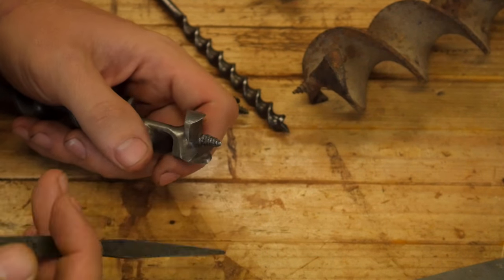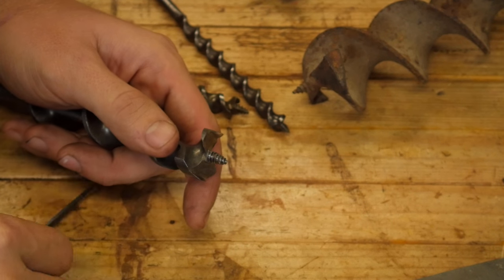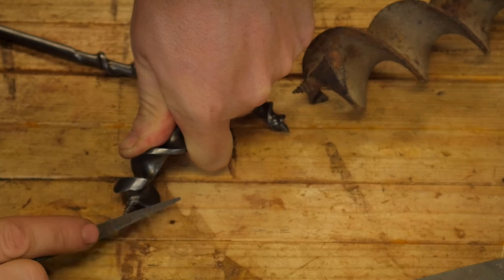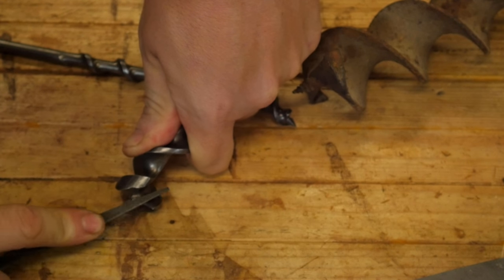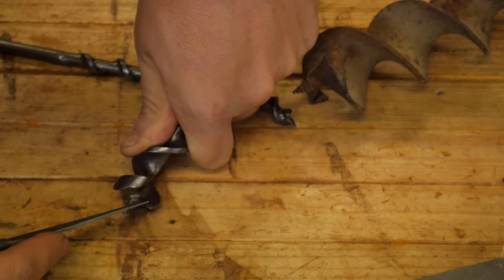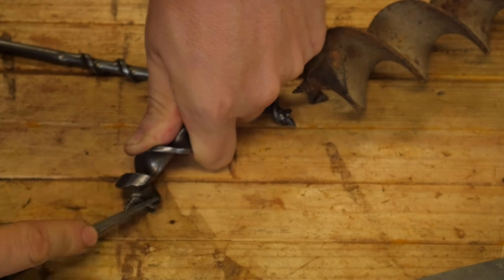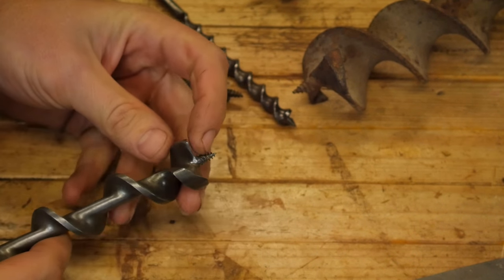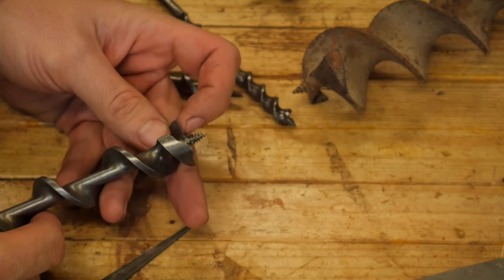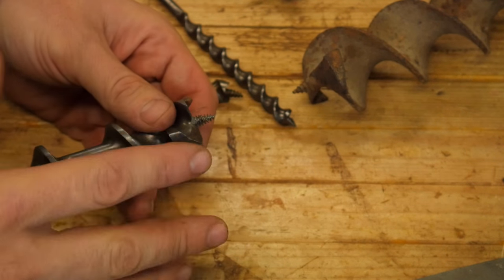The next thing is the blade. Generally, you don't want to sharpen the top of the blade because that will lower it, and if it gets too far from the spiral you start getting issues. So you want to sharpen the bottom of the blade. Put the tip down into your bench and come across with the safe side of the file so you're not wearing into the shank of the bit. A few quick passes — I like to sharpen away from the angle to keep the burr as clean as possible. You don't have to make them absolutely razor sharp; as long as it feels sharp, it will cut just as well. If you maintain and sharpen them well, they will last you a long time.